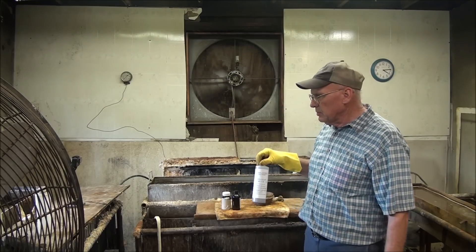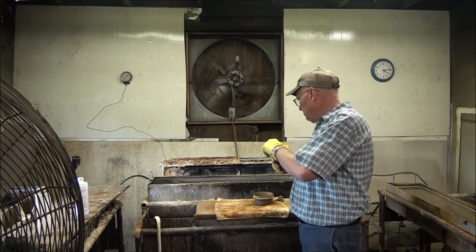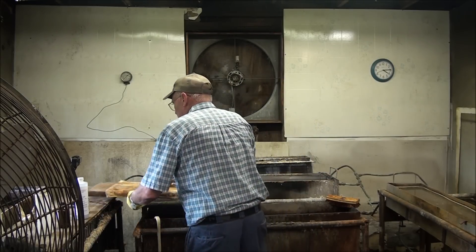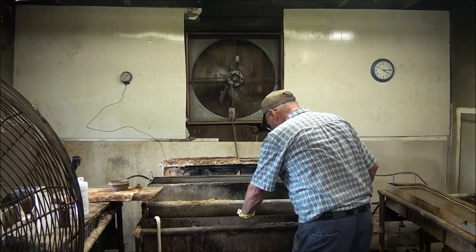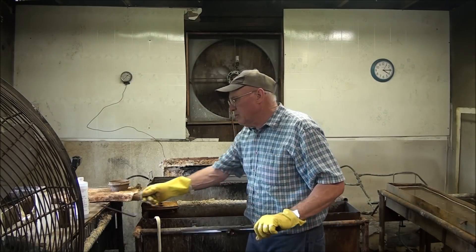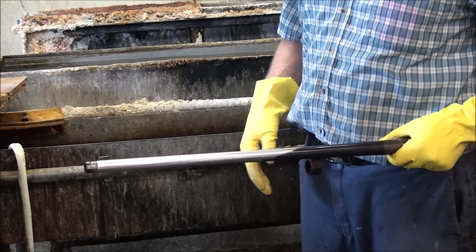I've got two of my products here. We'll use my Belgian Blue last. We're going to do three auto five barrels that we have cooking back here in the degreaser. Let's start with this product in the brown bottle. We're going to put it in our plastic bowl. Now we're going to need to set this aside here and pull out a barrel. This is a degreasing tank that cuts the grease and oil off the barrel — that's critical to do in any bluing process. Just for demo purposes today, I've got three junk auto five barrels and we've just polished the forward end and forward of the barrel ring, and that's what we're going to blue. These are kind of just junk barrels, but they'll serve the purpose for demonstration.